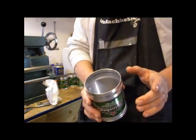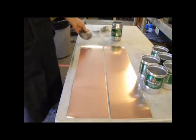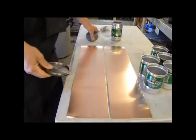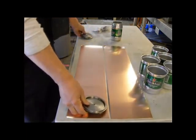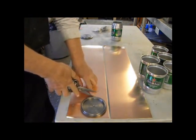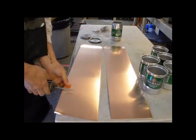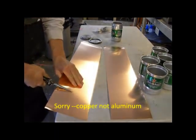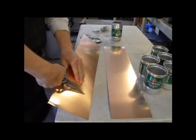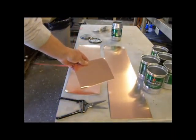Now we've got to go make a poison pot base. This is the die for the poison pot base that I've made. We simply place that — I'm going to get my scissors — place that on our pure aluminum and make a little mark, because we want it a little bit oversized. And then we cut a blank off here. This is not really easy to cut as thick, but these are real good scissors. If you take your time, you can do it. Okay, now we go to the next step: forming it.